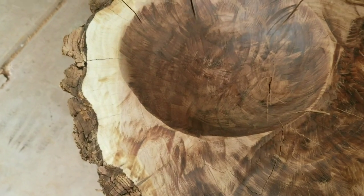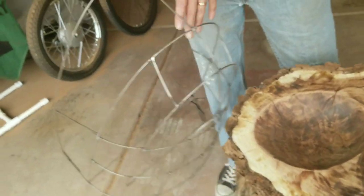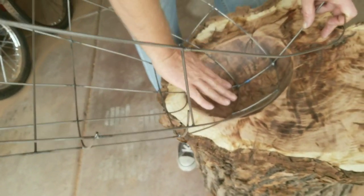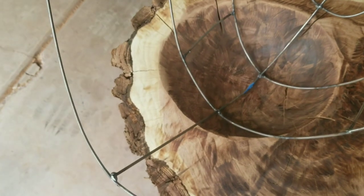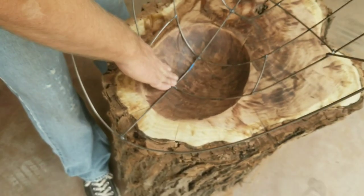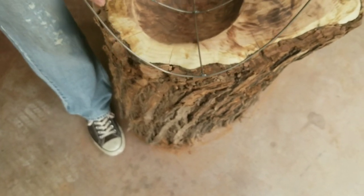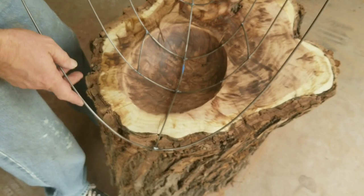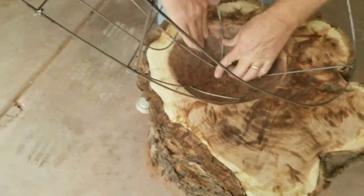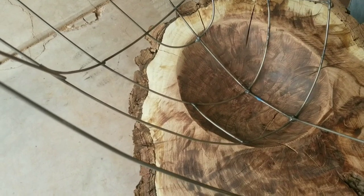I want to show you something cool. I've got my original wire form here and was looking at how this stump could also be used for metal forming — just hammering metal directly into the shape. Looking at this piece right here, the radius is almost the same as the top of the stump. If I flip it around you can see this area almost matches this section of the wire form. If I rotate it a different way, this is a little steeper over here — that won't work for this part but works really well for that one. Slide it around this way and you've got this top section — darn near a perfect shape. Just hammer that in flat against that area and you get exactly that shape. So you can use different zones of the stump for different profiles.